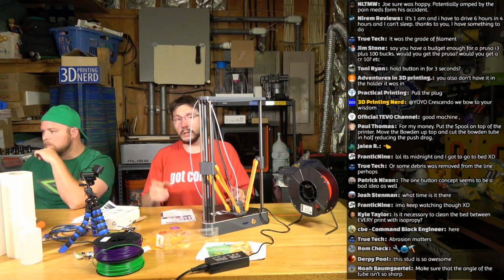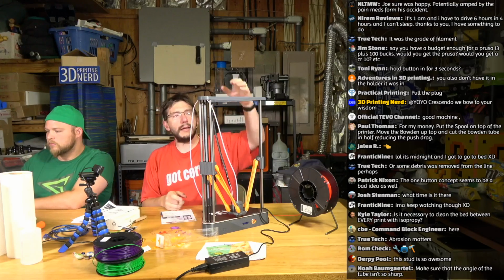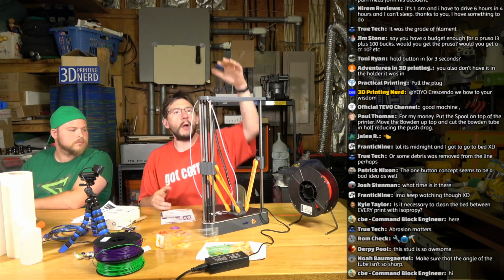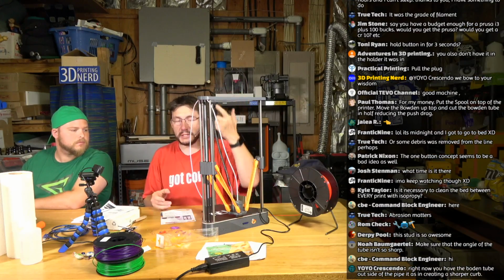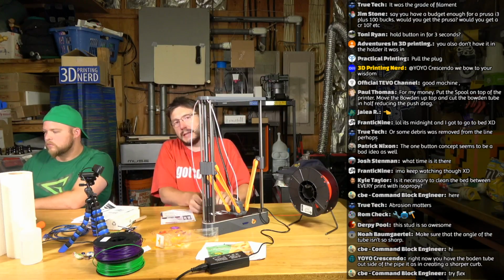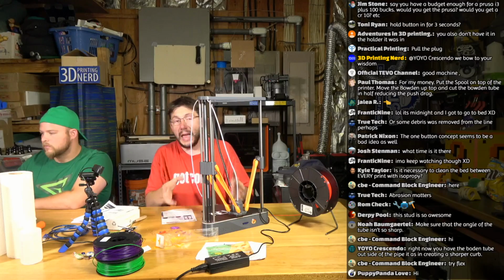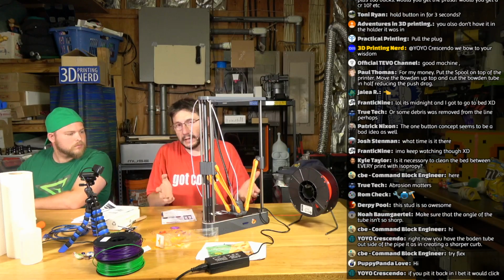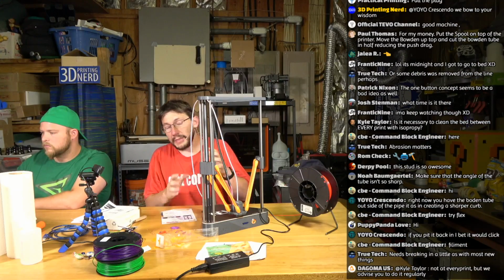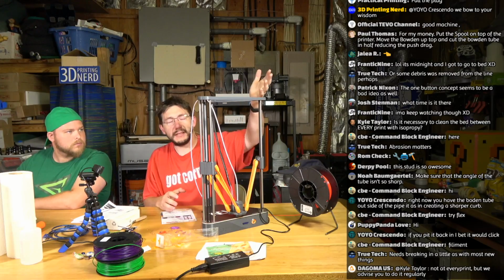Oh, sure. And a lot of people are correct, because putting the extrusion mechanism at the top is going to cut the length of the Bowden tube by more than half. And with the spool at the top and just funneling straight down, you're also taking out of the equation this 90-degree bend down here and this 180-degree arc at the top. What they have here is not a bad design. This design works. It's just able to be better.